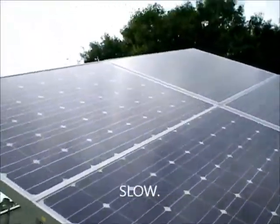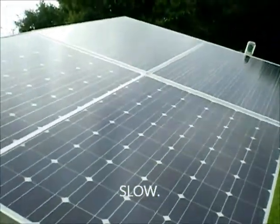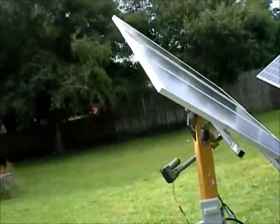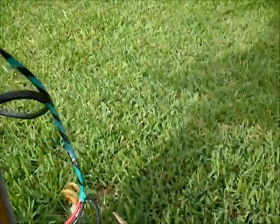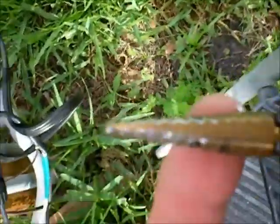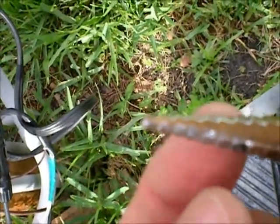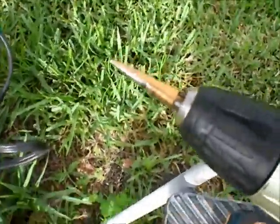What I've just done is put the dome up on these panels, and as you can see, that big tracker controls the little tracker. I'm going to show you how I did the installation. Give you a little tip here: if you're going to be drilling in your panels and you don't have a shield behind your drill, use a step drill, because you feel pretty damn foolish when you drill through your aluminum bracket into your solar panel.